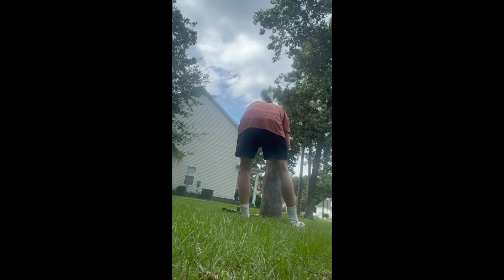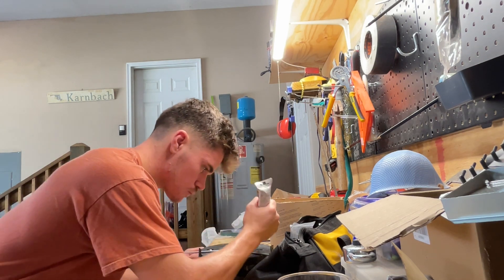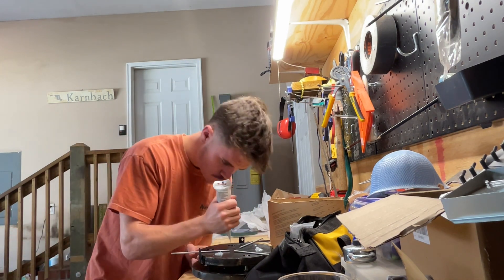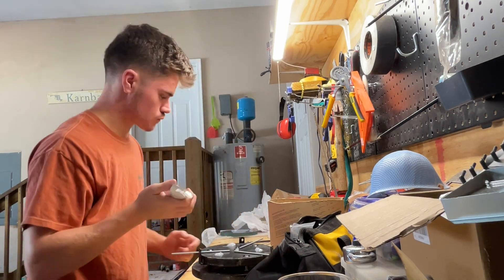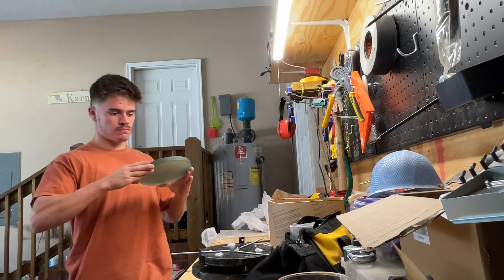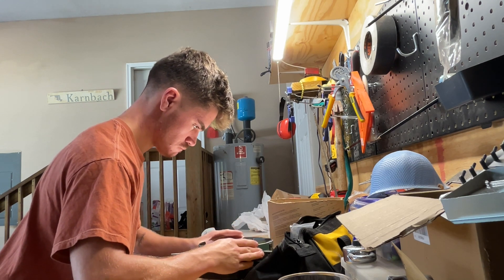Okay, and then I got right back into the fun and started painting the tube a red gloss. Another huge thing we did that day is we put the primary mirror on. You can see I have two or three metal rods that create a space between the mirror and the plywood — the reason we did this is so when we apply the silicone, the mirror is just sitting on top of the plywood rather than fully laying on it.